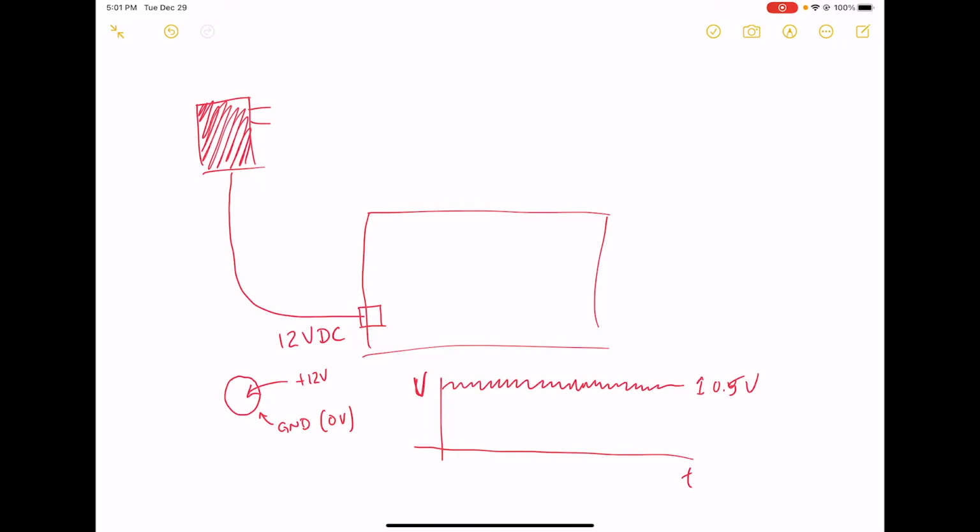For the first thing, we're going to use a thing called a voltage regulator. As the name sounds, it basically is going to regulate the voltage. It just makes sure that we always have the same voltage, 5 volts, on our power supply. The voltage regulator is called a 7805, a UA7805, and it looks kind of like this. It's got 3 pins. This is called a TO220 package.